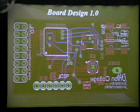You don't see it in the previous design, but that's actually a fuse that I use to prevent any excess voltage from burning out the circuit. It's actually a 1 amp fast-acting fuse, in case anything goes wrong. I also have notes here, I mean, silkscreen writing. To get this circuit designed, I went to Batch PCB, which I don't know how many of you have heard of, but it's a really good service for getting your circuit boards designed and manufactured.